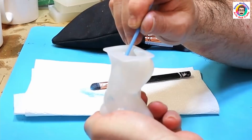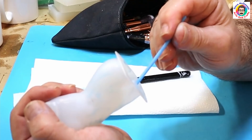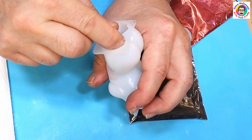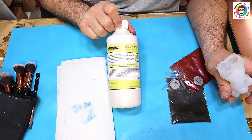I'm going to tap it out just in case there are any extra bits. I'm going to use the white polyurethane resin to cast this — I think that's the best bet. We've got a shortage of casting resins at the moment, so it's ideal. Polyurethane resin is actually cheaper than epoxy resin, it cures really hard, and it's normally cured within about an hour or two depending on temperature.